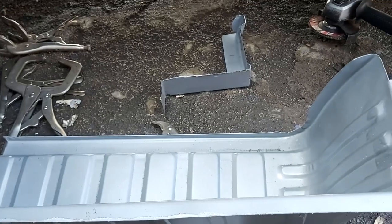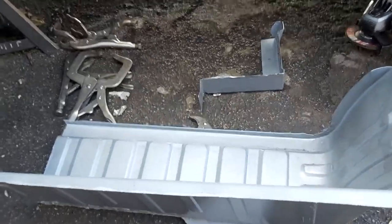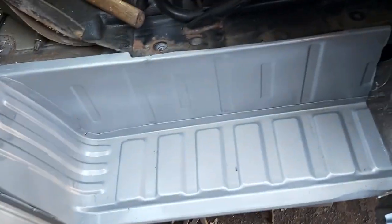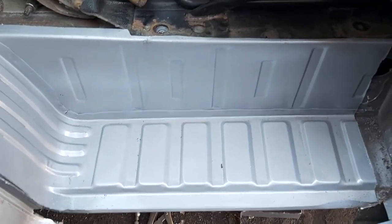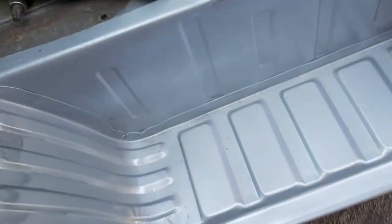Make sure you run off that edge and take the little bits of metal off so you don't have sharp bits — just a little tip. Now test fitting the panel I just chopped down. This being a custom made part for the van it should fit reasonably well — if you've got the skill to press and make that yourself great, but I found it much easier just buying one. It's got to be a tight fit, so there comes a time where some violence is required to make things sit down properly — just batter them in, get them to start fitting.